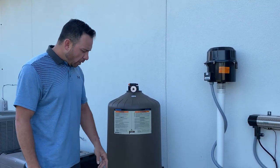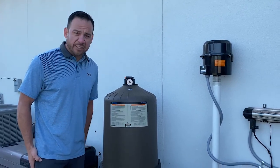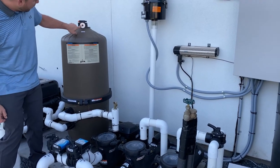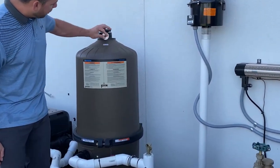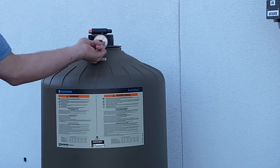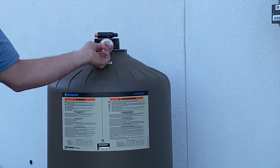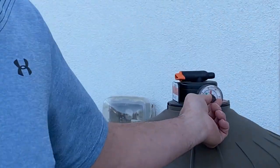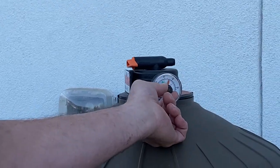So we're still waiting for this pump to get to full prime, and when it does, we're going to align our green arrow here. So the green and the red arrow move together, okay? They move with this little knob right here. There's a 10-pound offset between the green and the red, okay? And they are there just as reminders.